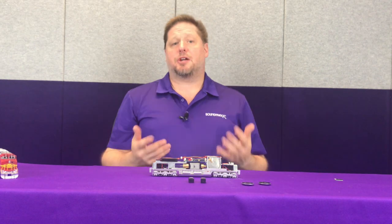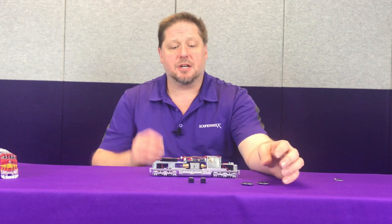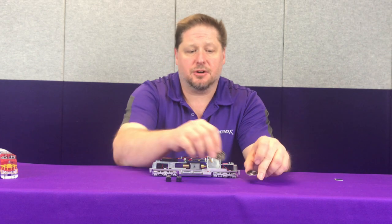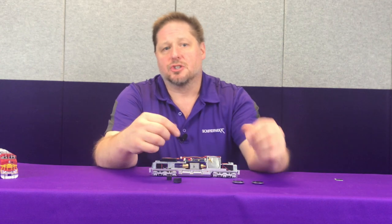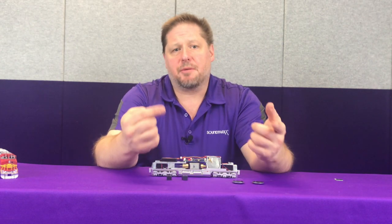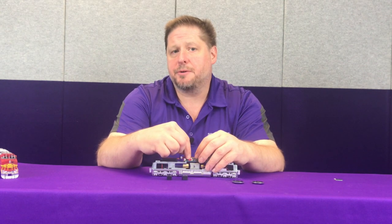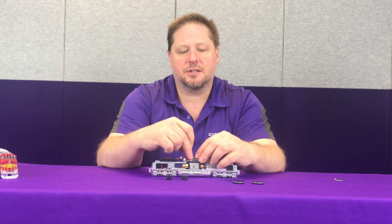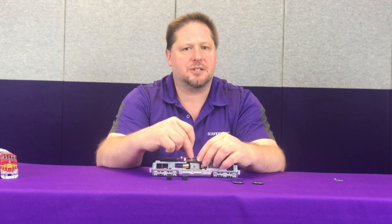You can go ahead and test fit to make sure the lights and motor work at this point. Now we're going to take our speakers and wire them up. Because I'm using four speakers, I'm going to use these two 30mm round speakers in series, paralleled to the two cube speakers in series. I'll make my solder connections and I'll also need a two-pin connector that we can plug into the harness on top. The other option, if you do not have that harness, is to find the two pins on the 21-pin for the speaker and wire to that trace right on the circuit board.